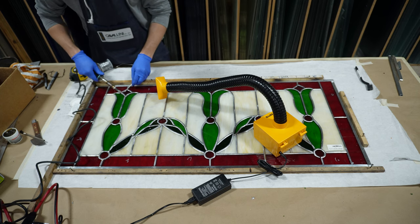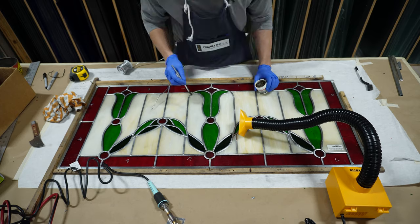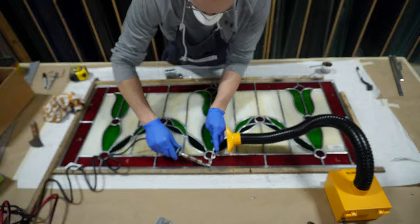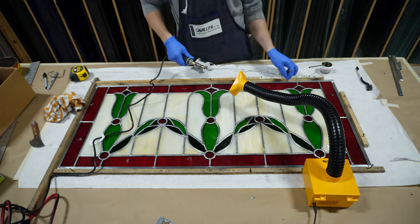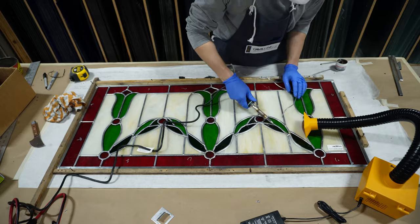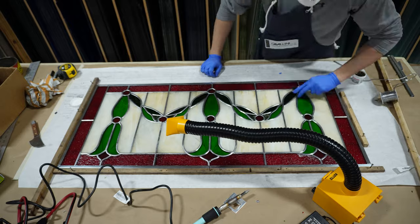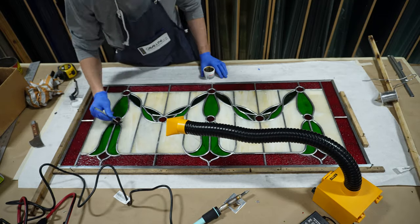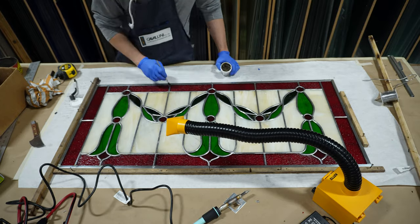This project was a little big for this little fume extractor, but it's definitely a good starter for someone doing much smaller projects. When I solder, I like to start in one area, apply the flux, solder, then do another area — normally about one or two square feet at a time. I find this to be a comfortable area that I can do before the lead starts to react too heavily with the flux, requiring an additional wire brushing and flux application. After some time, your iron can get pretty hot. When it gets hot enough, it can even potentially melt the lead, so be sure that you're not leaving the iron on the lead for too long — just long enough for the solder to melt and bond the two joints together.